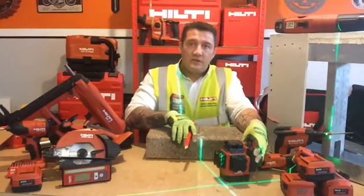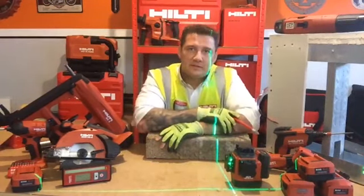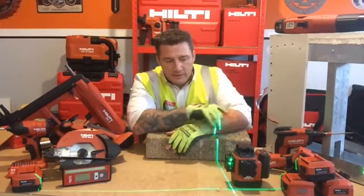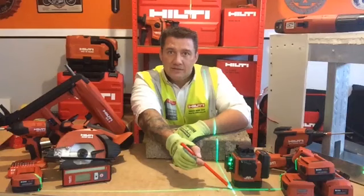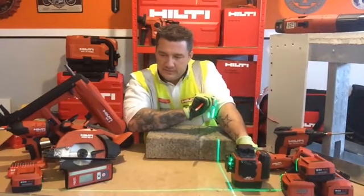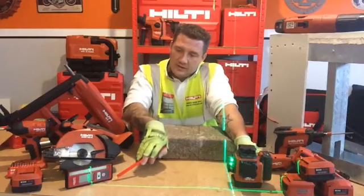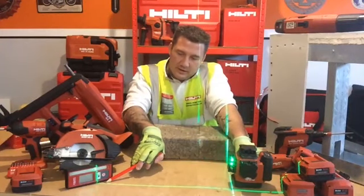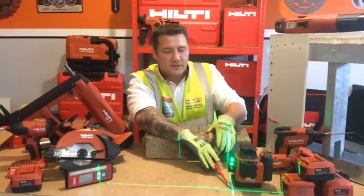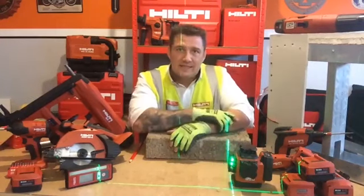A great feature is its fine tuning element. As you see here, we've got a crosshair. The main difficulty in setting out is lining up point A to point B — every time you move the laser, the whole line moves. What this offers you is a crosshair you can place on point A, and with point B over here by the laser receiver, all we do to get that line on point B is simply use the fine tune feature — a simple dial at the back of the laser. You'll see the line coming across the receiver meeting point B, and when the line touches point B, the crosshair on point A hasn't moved. This is the only laser on the market that offers this feature, where point A doesn't move thanks to the laser itself moving on an arc. This will save you so much time on the job site and makes setting out so much simpler.